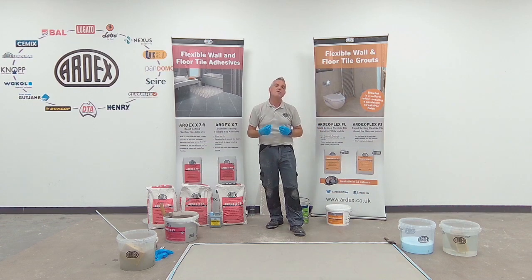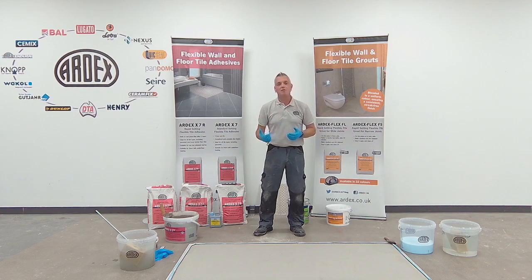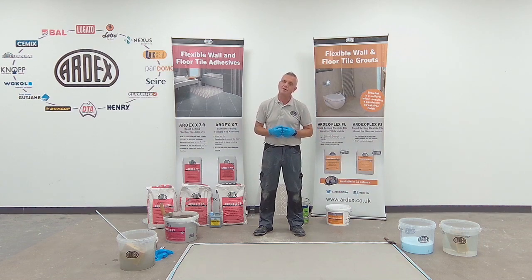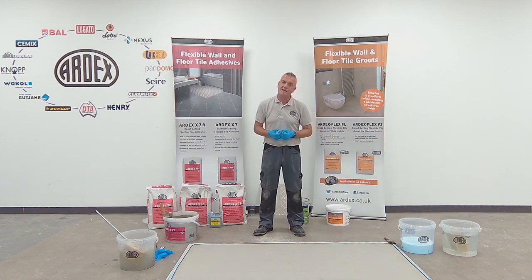Also, you've got to consider things like substrates. Now, we talk about air temperature being optimal at 20 degrees, obviously over 25, we start seeing some changes with performance and products. But the actual substrate that you're going on to is generally a lot higher in temperature than the air temperature. So that can actually raise by, it could be in some cases 10 degrees.